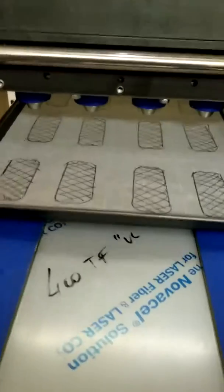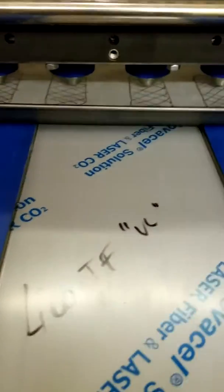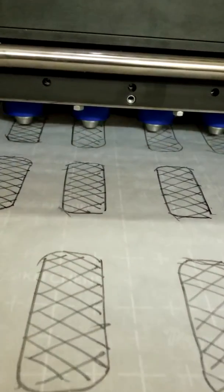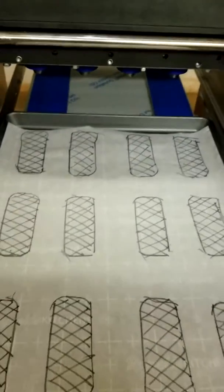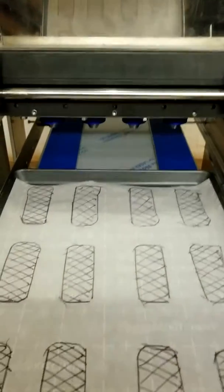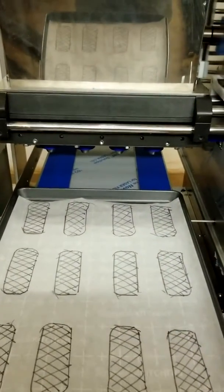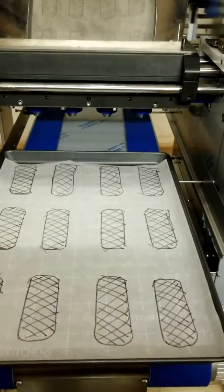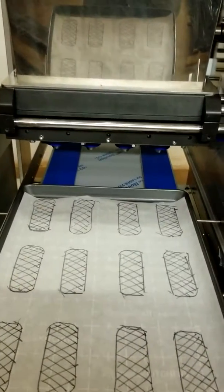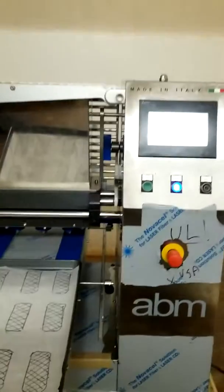As you can see, the pan passes through and I can control how close the nozzles are to the tray. It will deposit down the length, and you can add a small wipe-back function to remove the tip of the product. We can control how close the nozzles are to the tray, how thick of a deposit you make, and the shape of the nozzle. Different from the manual operation you're running now, the machine handles the shape, size, and weight — that's all part of the setup and programming for the particular product and pan.